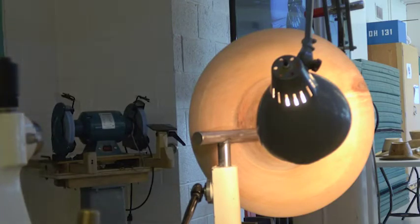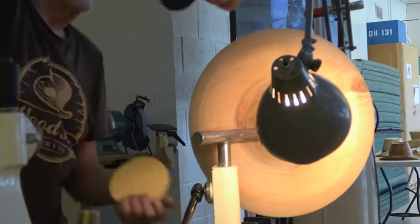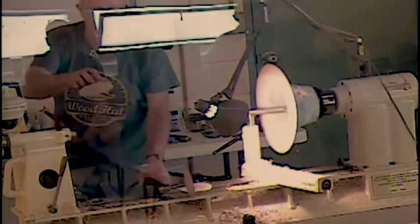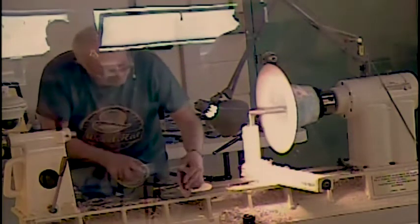Mostly I use the 6-inch extension that way, in the drill press. If you don't have a drill press, you can put a chuck and do it this way, on the lathe. These backup pads, when you see the stock ones over there, are pretty stiff. They're kind of like this, you know. This is a different brand, but they're very stiff. So I grind the back off to make them flexy.